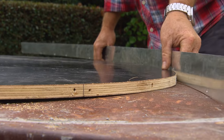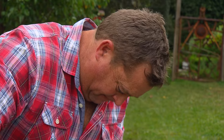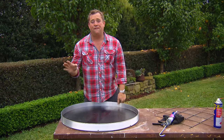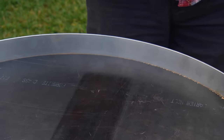This aluminium bar is going to be my form work around the sides. We've got our form work that we can fill with our concrete, but at the moment there's a hairline crack all the way around the edge, so if I make a wet mix it'll fall through. And when you take the form work away, that 90-degree angle has the potential for chipping or sticking to the form work, and you won't get a really nice finish.